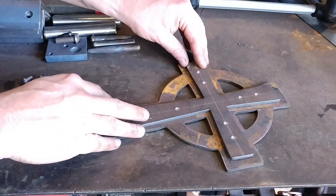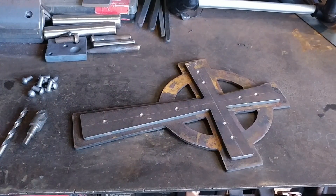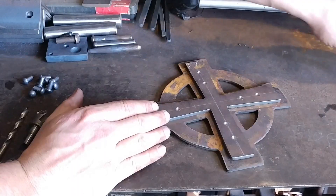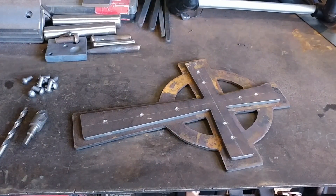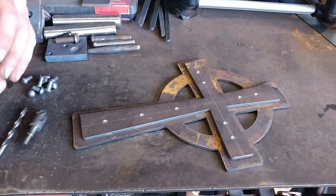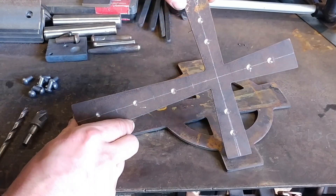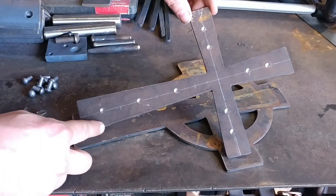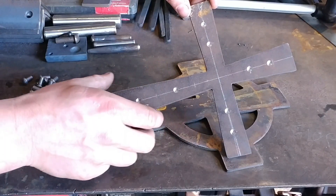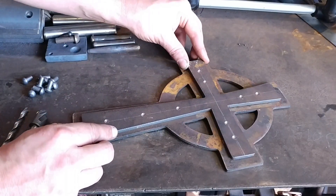When I say you can forge this cold, you can forge this cold with just an anvil and a fairly heavy hammer. My ideal of a fairly heavy hammer is a three pound cross peen. One important thing to point out before we get going: I just roughed out where the drill holes are going to be, but I did not drill the holes yet — because as we peen up these edges the metal is going to stretch, and that's going to give us some wonky looking holes.